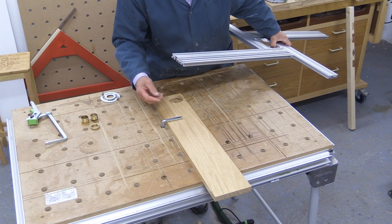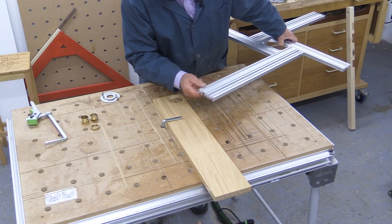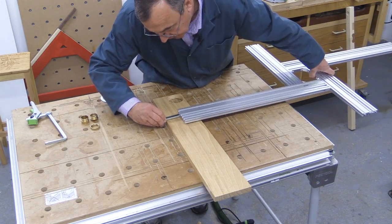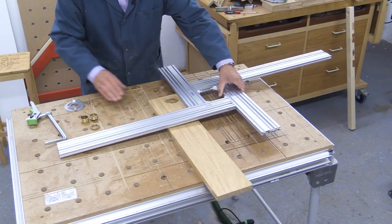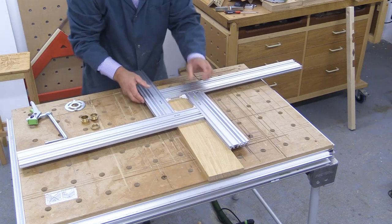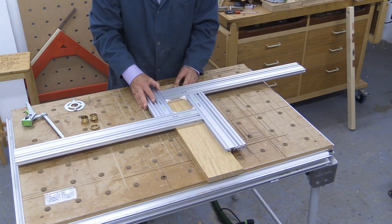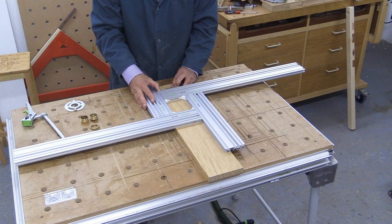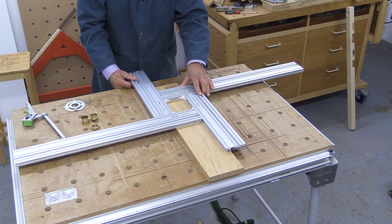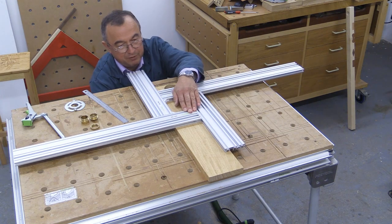Part of my clamping strategy is this Festool clamp coming up from underneath my MFT3. I'm going to put it in the channel on the MFS, which is designed to take a clamp like this. I'll feed that in there and move it across to the position I want. Obviously, if this were for a particular job, I'd need a scheme for precise placement — but for demonstration purposes, that's fine. I'm now going to tighten this clamp from underneath.